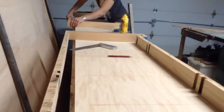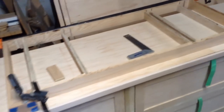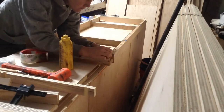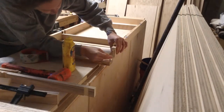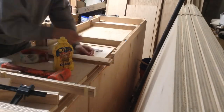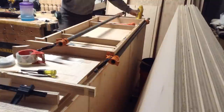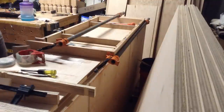And the same thing with the other piece as well. These are those smaller strips of plywood — the reason they're shorter is so when I put the base in, it will be perfectly flush with the front. These through dados won't be seen because the cabinet pieces come to the front, and I can fill them with scrap oak. You can see how the vertical partitions are going to be sandwiched between these pieces and everything is square. This is the most important part of this build — if you don't build this square and it doesn't get glued up square, you're going to be fighting the process the rest of the way. That is why this entire video takes the time to show you how to do this.